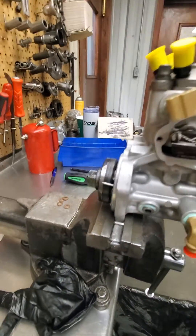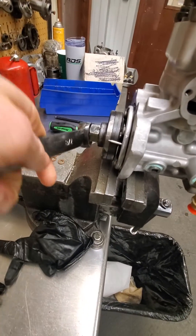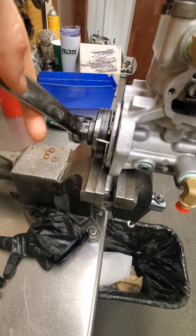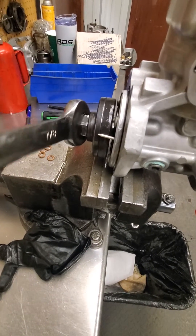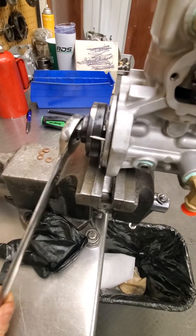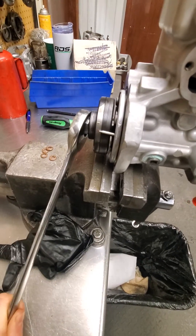You've got to see this line and the internal line at the same time. If I turn this pump over one turn, at that point I was lined up on number one cylinder, so I'm going to turn it over one more time and line my mark up.